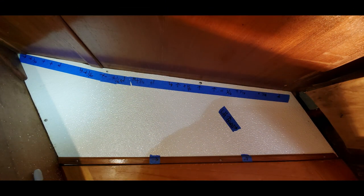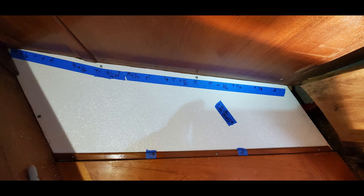In the very back on the sides there are vertical white plastic panels, and we're going to do the same thing there. On the blue tape I've already written down the measurements of the gaps and the extra edge margin we need to add. We'll take that home, transfer it onto a piece of door skin — or if we're feeling brave, go straight to teak plywood. We'll maintain the shape, make it a little bigger all the way around, and shoot for high quality like always.